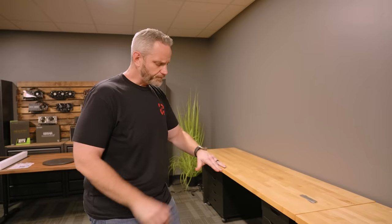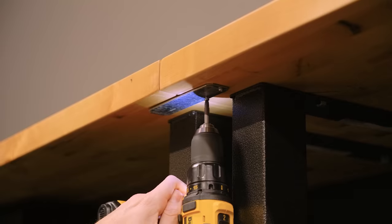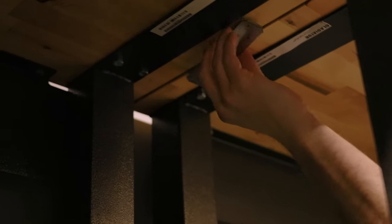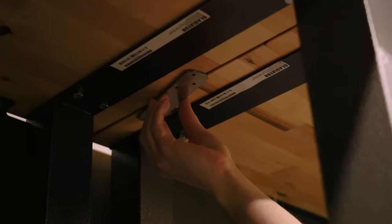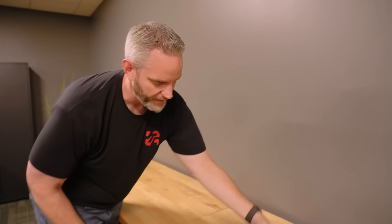This is also what I did at home with my L-shaped desk so the perpendicular desk would always stay perfectly at the same height once tied together, then I adjusted the feet to level them. Because I can't get to the rear back there since there's no overhang, I can go diagonal between the brackets and that will still work the same way. Put one screw in so I can pivot it, put the other screw in, do all six, and it's definitely more level now.